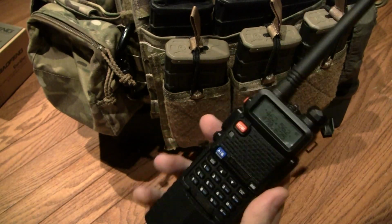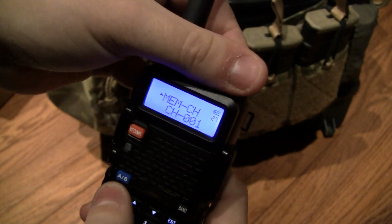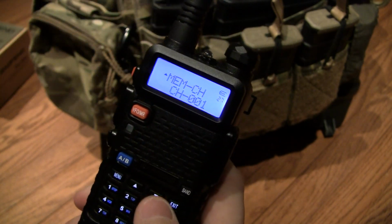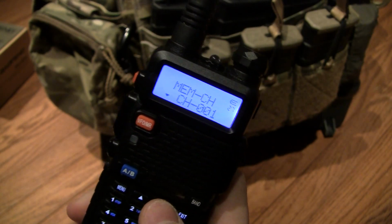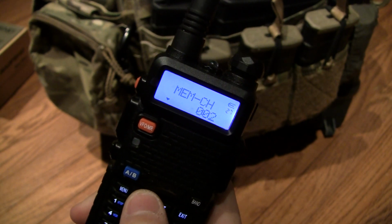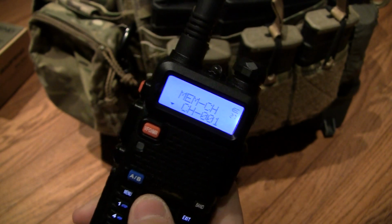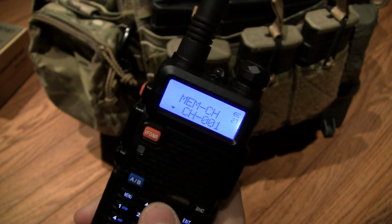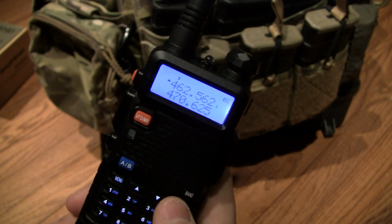And what you want to do is, we'll do one more just for the sake of it. Back to menu. We'll turn that down there. Back to the menu, and we'll go to memory channel. Just to show you that programmed in. See how it says channel 001? If I hit up, you'll see that there's no CH for channel next to it. That means that this channel is open. That channel is full. It's got a frequency programmed in, and that channel is open. So go ahead, and we'll leave it on 2 for the heck of it. And we'll exit out, and we'll do channel 2.